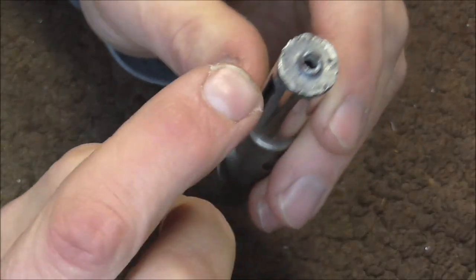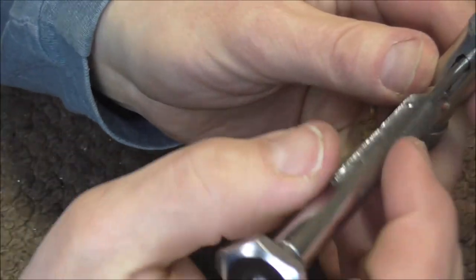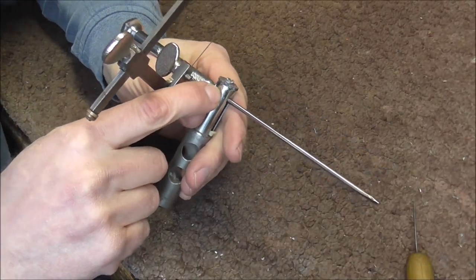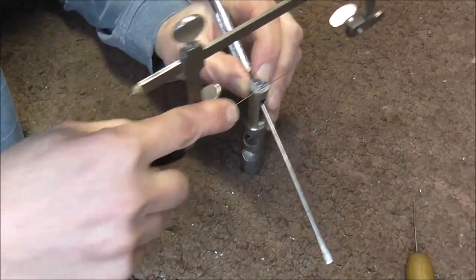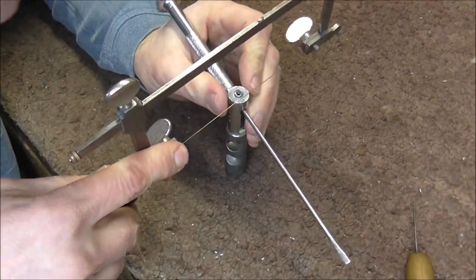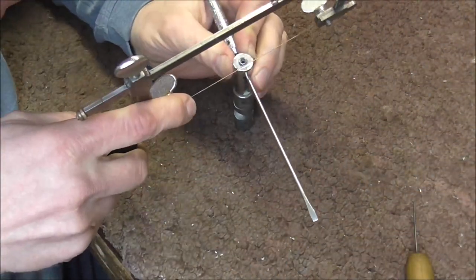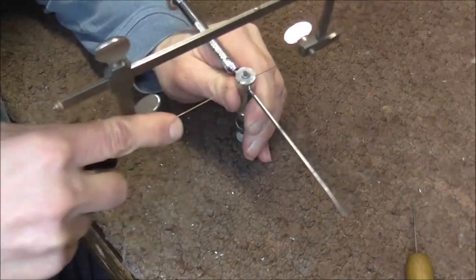Now for the valve with the broken-off valve stem — this is almost always the way that you find them when they are broken. I'm going to get the spring out of the way by pushing it down and putting a screwdriver in there and pulling it out. I am going to use the jeweler saw to cut some slots in the valve stem. I am only going to cut the valve stem — not into the valve itself. I am going to cut the valve stem until I get to the valve and then stop. This would be a little easier to cut if I could put it in the vise, but I'm not going to do that because that would ruin the valve. I am checking as I go to make sure I do not go too far.